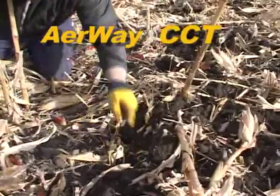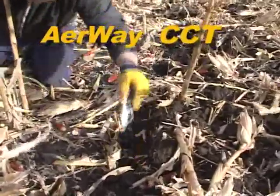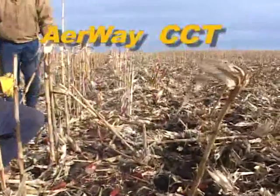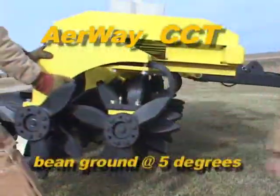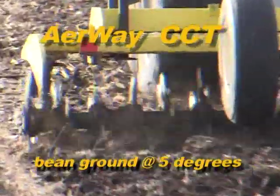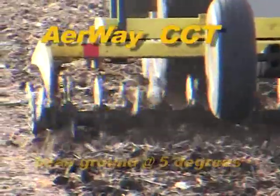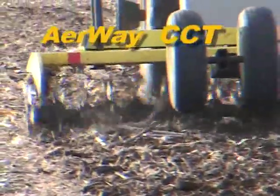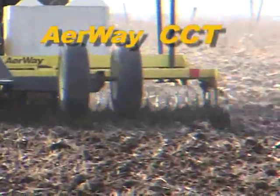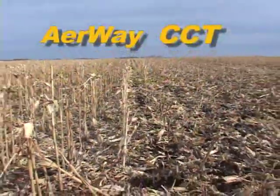By shredding the corn stalks and mixing soil in with the residue, it will break down faster than just cutting them. By changing the angle of the machine, like say in bean ground, a lot of times I go 5 degrees versus corn stalks maximum degree, we have no problem going in right behind the combine, even though on a good dry day you'll have more shredding of the corn stalks or bean stubble.